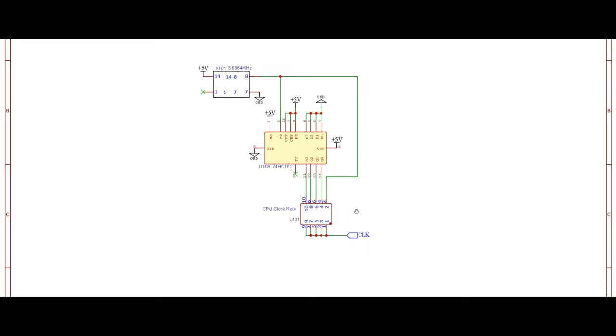And also, later on, we'll be building a UART module, which is our module that connects to a PC or Mac, and you'll be able to make a terminal connection to our computer as your input-output terminal. Those UART modules need a specific speed to be set on both sides to work properly. We're going to talk about that later, but for now, setting a specific speed here will enable us to match that speed on the other side in the UART module, and we'll be able to connect our computer to a terminal program. So this is really all about the clock module.